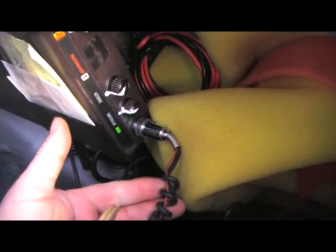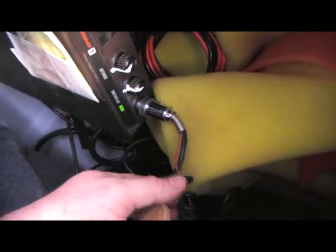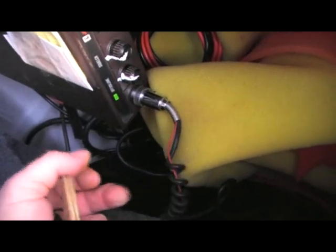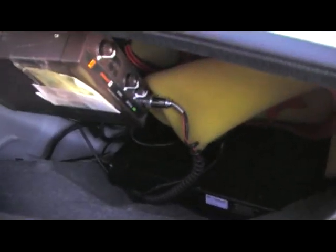In the wife's trunk, I've got an old EF Johnson radio modified for APRS. Power comes off the mic plug — audio and everything comes out that way. That goes to a DB9 connector. My wife also has an Astro P25 radio mounted in an undercover fashion in a center console.